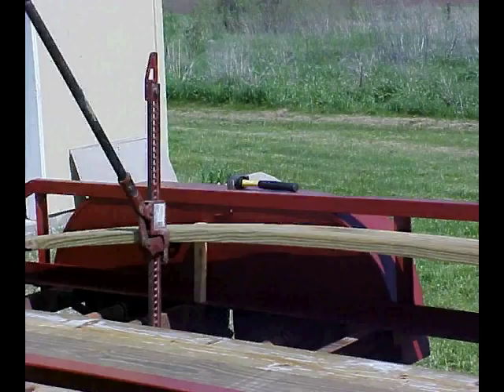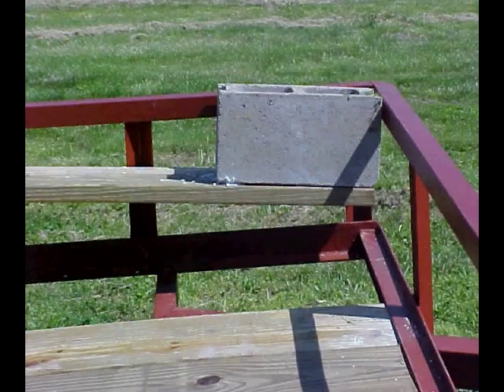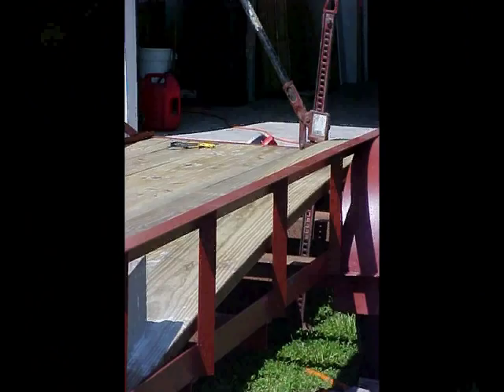You may need to press down the board with your hand and block it up. Next lower the jack and the board will slip into place. This method works fine for boards six and seven on your deck.